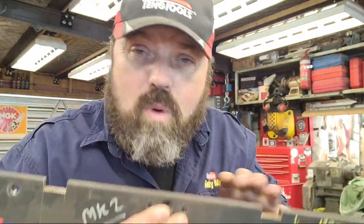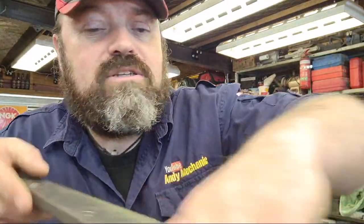So I had to cut every one in half, grind gussets, cut out the 40 mil, grind a groove on both, weld them up, and then flat them back off. Took me a whole day to do 12. It was just an absolute ball ache. It was a sham. I think I waited till lunchtime before I pulled the pin and got on with it, because I was fuming. I was not happy at all. And yeah, I fixed it, but man, a whole extra day's labor.